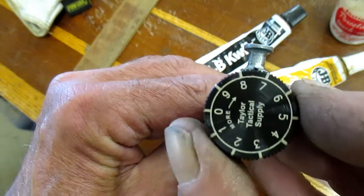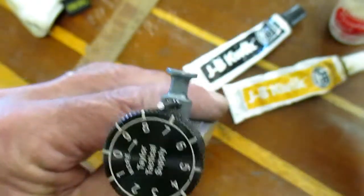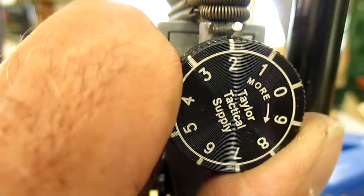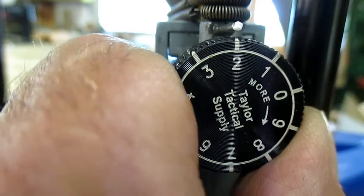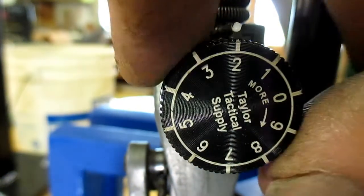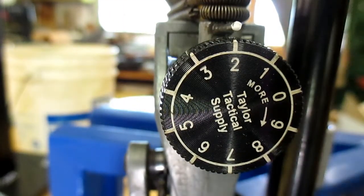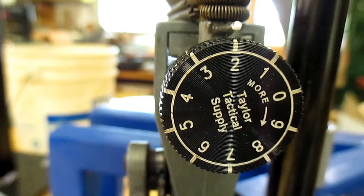Like I said, I might put another groove in the middle to fine tune — I don't know if I'll even need it, but that's that set up. Got it back on the machine. Now you can see I've got a nice reference point for dialing things in, and this will make it a lot easier than using a wrench. Every tenth of a turn is only moving the adjuster inside five thousandths of an inch — so that's pretty fine adjustment right there. With the case feeder and everything else, this is a pretty tricked-out Dillon square deal.